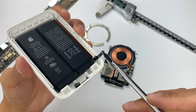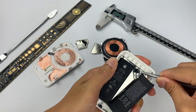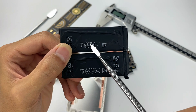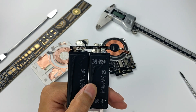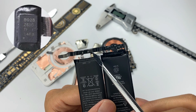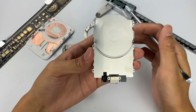The battery uses a special connector to connect to the PCB, which is relatively rare in power banks. Metal heat sink and copper foil are attached to the shell. The battery brand is ATL. The energy of a single one is 5.733Wh. The two batteries are connected to the protection board by spot welding. A battery fuel gauge chip from Texas Instruments — BQ28Z610 — is on the protection board with integrated protection function. There are two metal shells at the bottom, and the back side is completely attached to a metal plate to ensure heat dissipation.